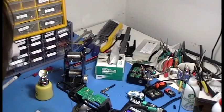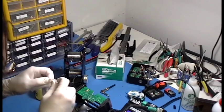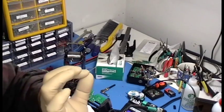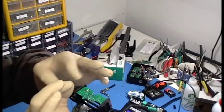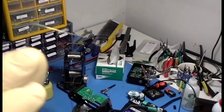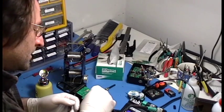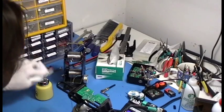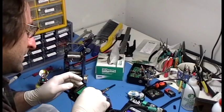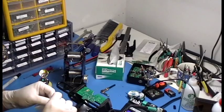But all I'm doing, to bend these, the way I've sized the board, and this isn't strictly the absolute best way to do it, but it works adequately for what we need. These are sized so that the actual bend is right up against the body, so you can just come in with your finger and just bend it like that. Now it turns out there's enough of the package here that you actually still get a nice radiused bend. We're not making sharp bends here. You don't want to make sharp bends. You want to make nice radiused bends. Okay. But sizing it like this just makes it easier for me. Number one, it takes up less space on the board, and number two, it makes it very easy to bend to get them in, which is important when you're making lots and lots of these. You know, you have to build your boards for manufacturability, of course.